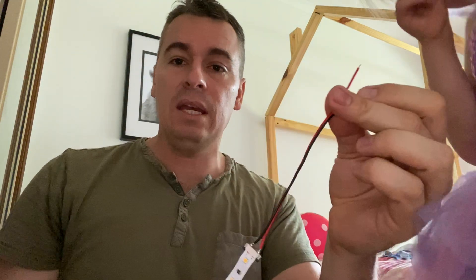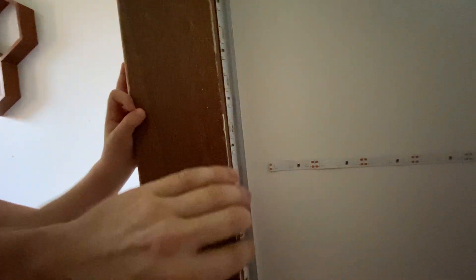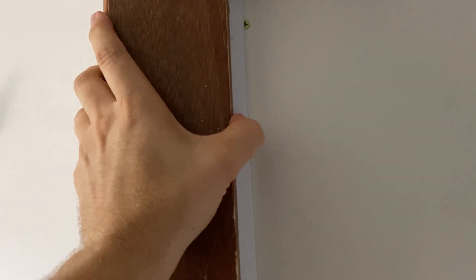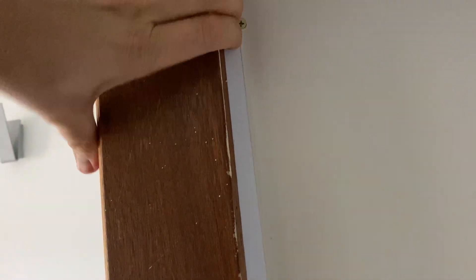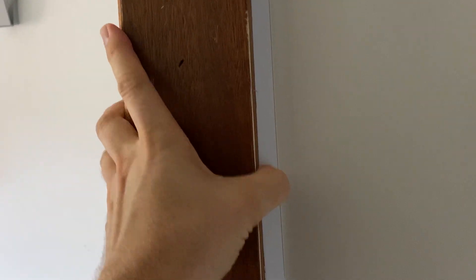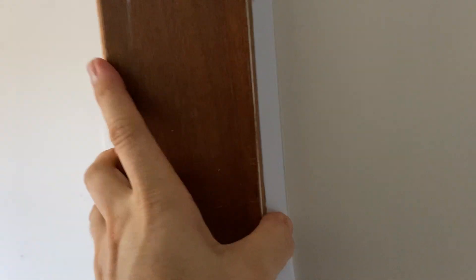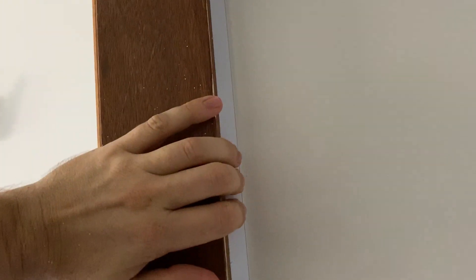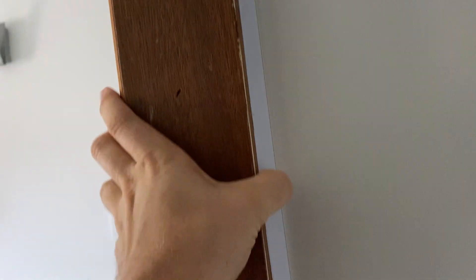You can also solder or make your extra length cable straight away. Lyra has put her strip here and I've managed to get mine into the profile. One thing to watch when you put screws into the profile is to try to recess the screws as much as possible — that will make sure you don't end up with big lumps when you run your LED strip over. We have some spare strip. Just push down from the top and never start in the middle unless you're forced to, because you can end up with a bubble that's really hard to get out. Start from the top, push it in, then work your way down. I've used the ALU-2 aluminium standard profile, so it's flexible at a 45 degree angle — I preferably would have gone with the corner profile had I checked the installation beforehand.